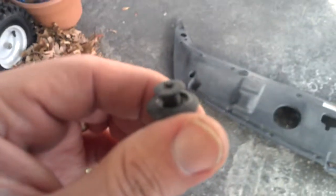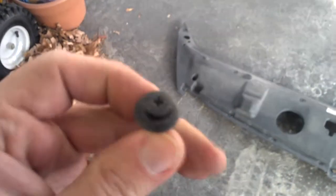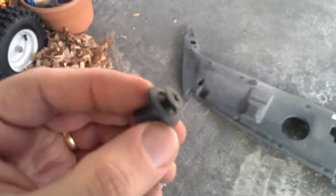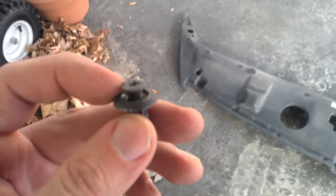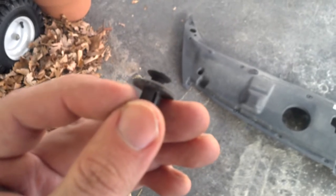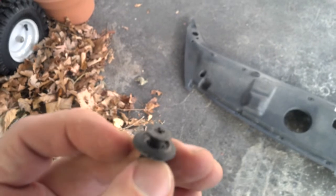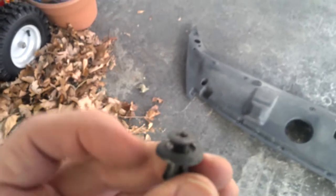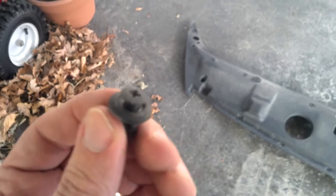I had a little bit of trouble with some of these — they weren't unscrewing and the screw wasn't coming out of the rivet. What I did was put the flat edge of a screwdriver underneath the base of the rivet where my index finger is, and then started unscrewing with a Phillips head. That seemed to give it the bite it needed to pull the screw up, and then I was able to unscrew it by hand.